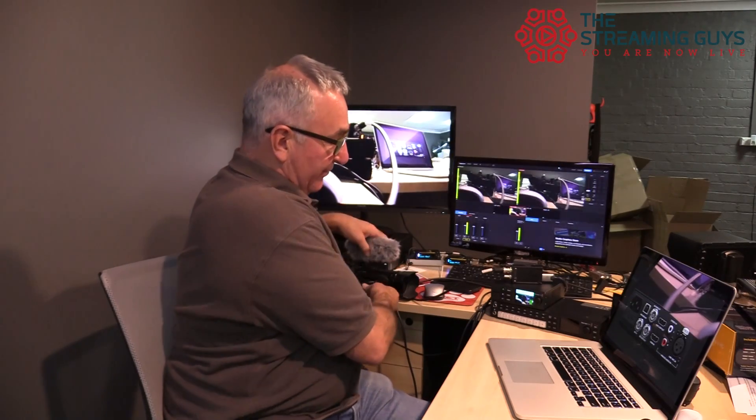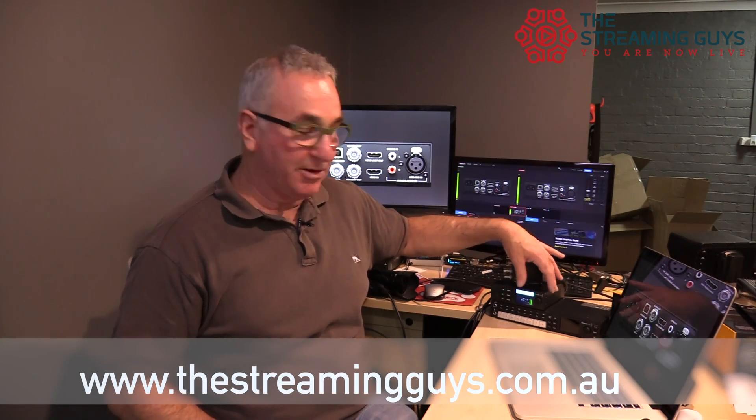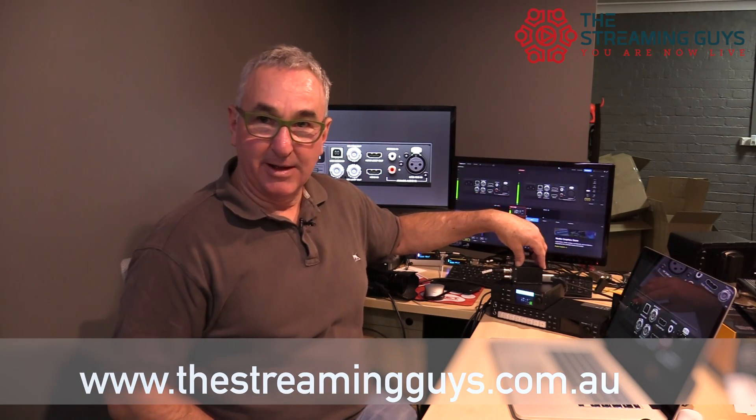The HDMI source from the consumer grade camera is recognized by the Atomos converter and outputs to SDI into the back of the Web Presenter. And once again I can just cut backwards and forwards and that would be live to your stream. So the functionality of the actual Web Presenter is fantastic. Works with all streaming software, works with all HDMI to SDI converters to allow you to run two HDMI sources into your Web Presenter live to your stream.